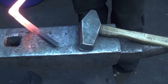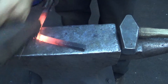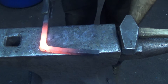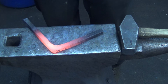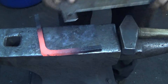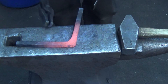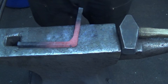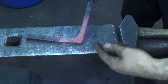So there's our punch mark - this must be the one. This is about 5 and 3 quarters, so we're an eighth inch over. And you can see we have a fair amount of upsetting back to do right in this area, so that'll come in right to 5 and 5 eighths.